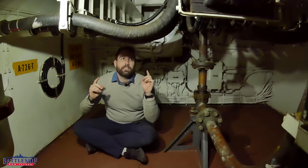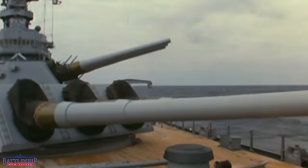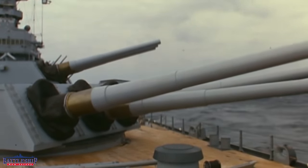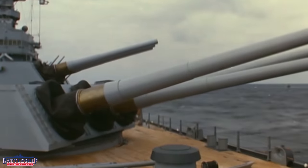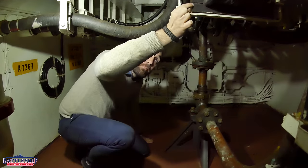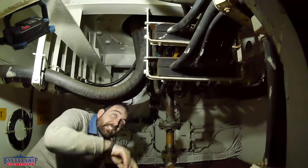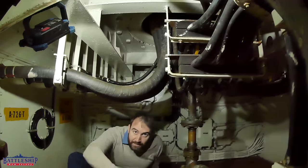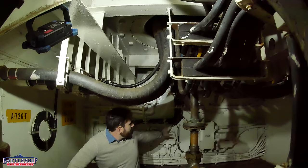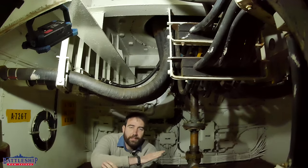It's critical that these cables come up the center of the turret because the turret is a rotating structure — we can't just have them coming up anywhere or they will get pulled too far as the turret rotates. You can see that each of the cables is pinched in place with Bakelite brackets sandwiched together to hold the wires in place and keep them from being pulled out. They are wired into their boxes with metal brackets, and those are what keep the turret from rotating too far and pulling the cables.